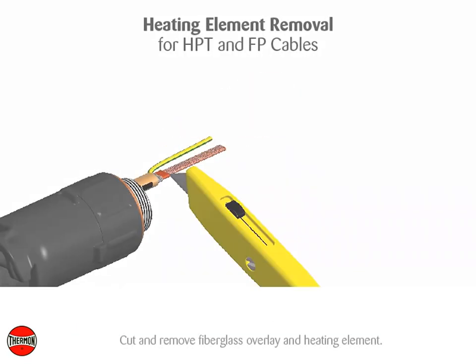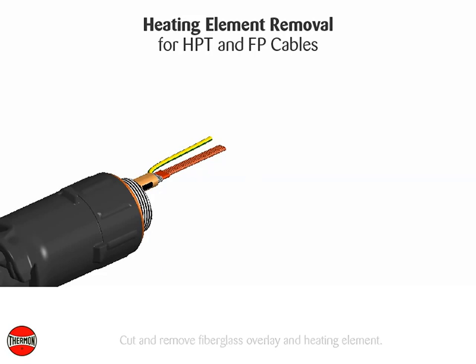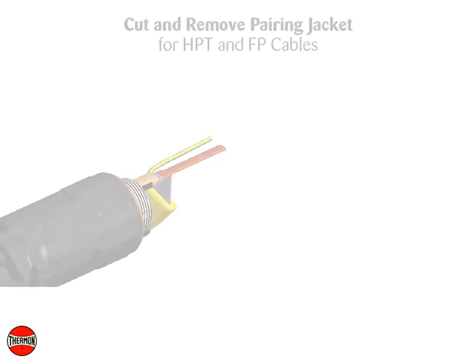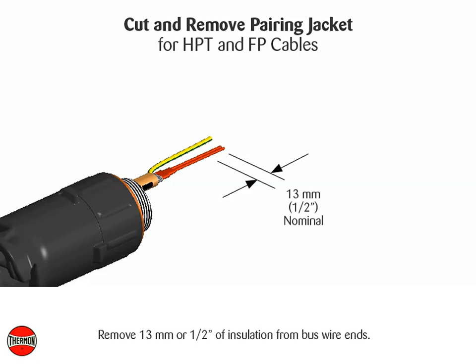Cut and remove fiberglass overlay and heating element. Push any remaining heating element wire under the primary insulation jacket. Cut and remove pairing jacket. Remove 13 mm or 1/2 inch of insulation from bus wire ends.